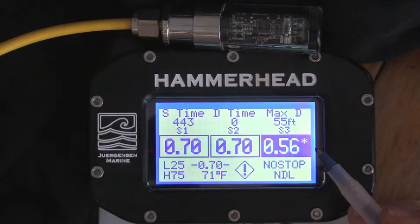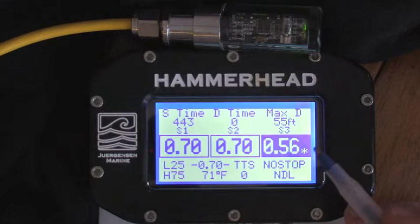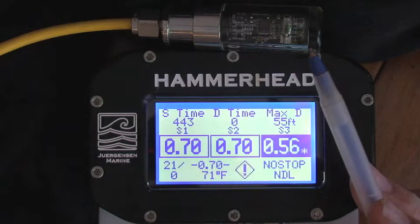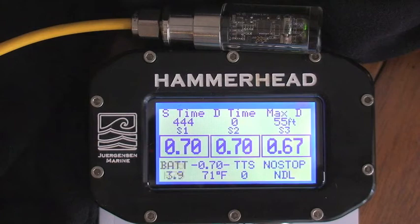The second warning will occur on the DIVA. A blue LED serves as an alert to the diver that a condition exists which warrants their attention. Notice that the green LED indicating adequate life support in the diver's loop continues to glow. Should the sensor move back into acceptable range, the alert condition will stop and the system will return to normal.